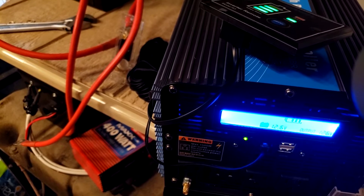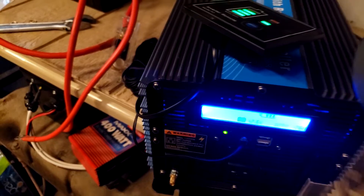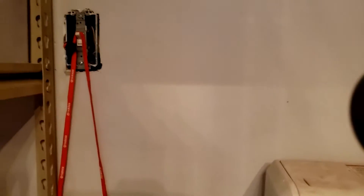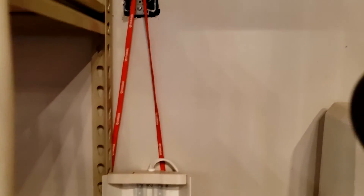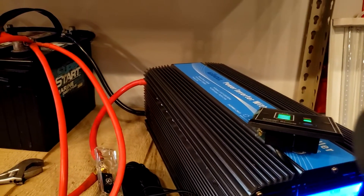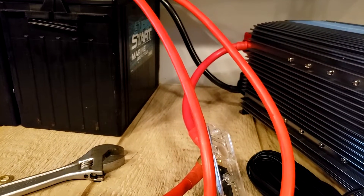These solar panels are 400 watts — you can get them on Amazon and I'm going to add a panel, so that's going to put me at 500 watts. Right up here above the stove, we're going to put the charge controller right here next to this switch. Then run the wires over here to the battery and inverters. I'm sure I'll have to get some custom-sized cables because I'll need all my fuses in there — the big fuses and the little fuses that come in off the solar panels have to have fuses on there.